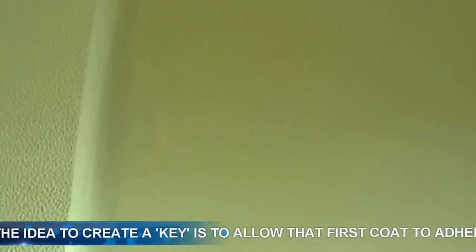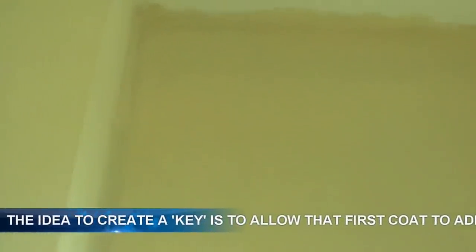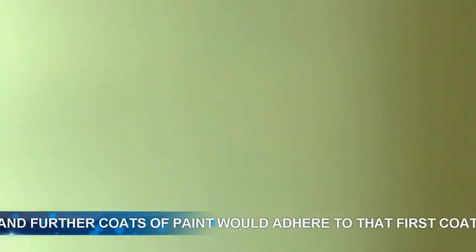We have the wall fully painted now. Fully painted. That's the first coat of very, very watery matte emulsion interior ceiling and wall paint. Hopefully you might be able to see that it's looking quite patchy. You can see little patches, but that's fine. This is ideal. It doesn't matter if it's transparent and patchy, as long as when you roll or brush, you cover every bit of wall with the watered down paint.